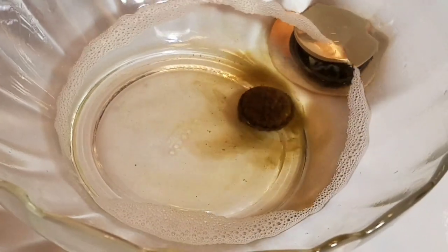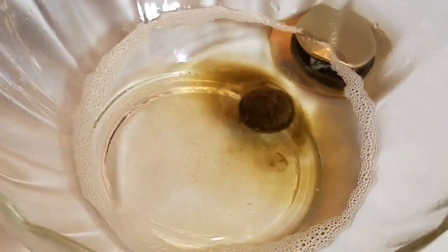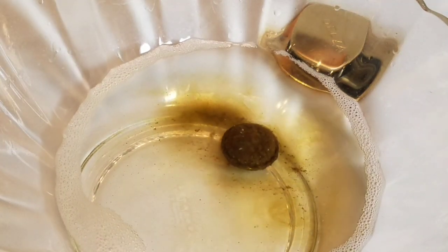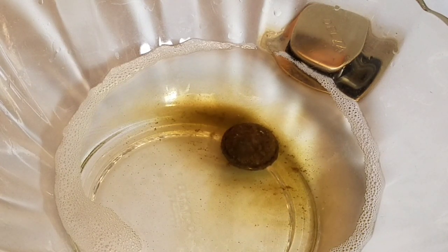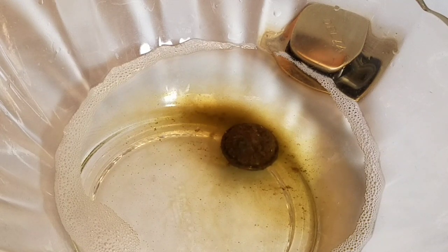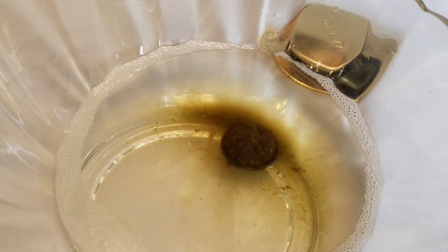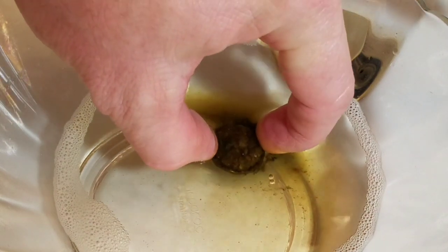It's already starting to react pretty well to the ammonia bath. Look at all this corrosion coming off — you can already see. I'm hoping there's going to be some gilding left on it, maybe around the rim and all that nice stuff coming off. I've tried this with several other buttons with really good results. Once I'm done I'll fine toothpick it to clean it as best as possible, brush it a few times, then flush it with some distilled water and let it dry out really good. It's been in there for probably about three minutes. You can see all the corrosion that has already come off.